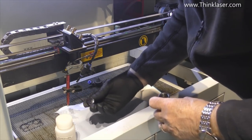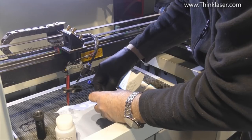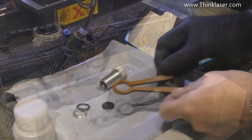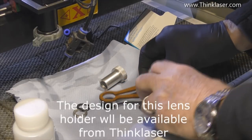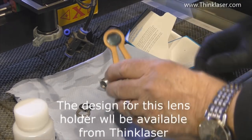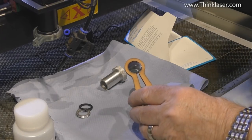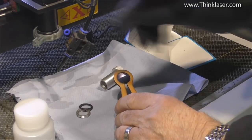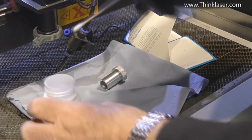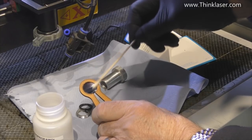The lenses come out stuck to the retaining screw because the screw has an O-ring on it, and the O-ring tends to stick the lens to it. There we go — the lens is out. The removal tool is manufactured slightly undersized so you can open it and pick up the lens, clamping it around the outside edge so you can get to both sides without touching it with your hands. Now, only use isopropyl alcohol for cleaning, and make small circular motions away from the center.